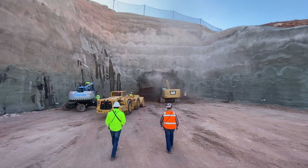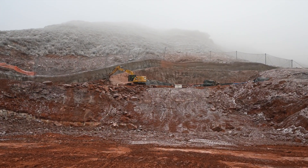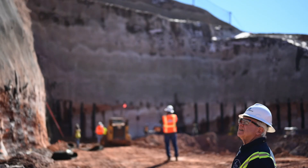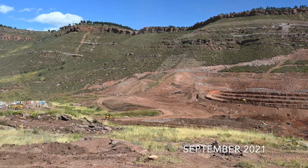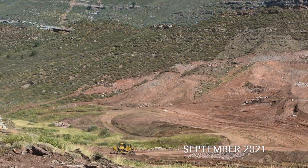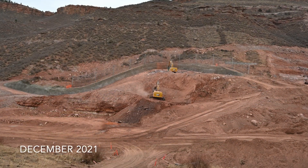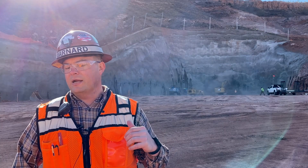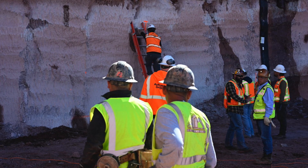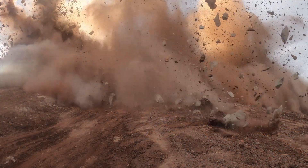We've been building the downstream portal for the last five months. That includes shotcrete, soil anchors, and rock anchors. It's taken quite a bit of planning to construct it safely. Standing behind me was native ground — we had to uncover the overburden and then start our common excavation at the very top. You can see on the left and right hand side there are benches going up to the top. Once we got that bench established, we were able to come in with our drilling and blasting crews and blast out the rock material beneath it.